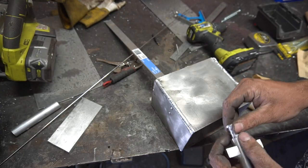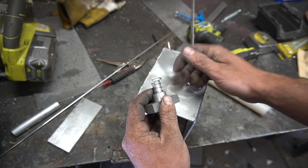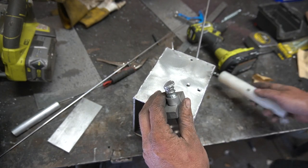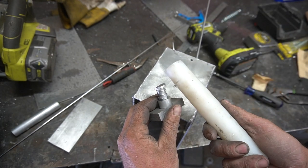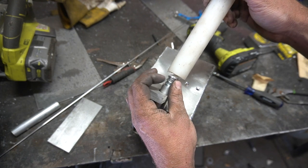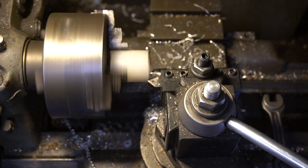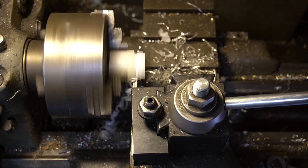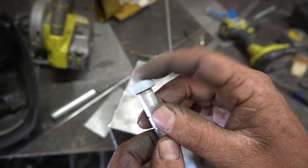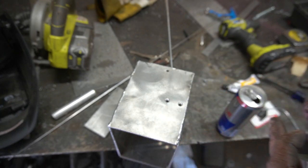I've been playing with this thing and it seems the aluminum bar rubbing on the aluminum is just wearing each other down and it's too grippy — it doesn't slide very nicely. So I've got this chunk of Delrin. I'm just gonna make a little cap that I can epoxy on the end of this and hopefully that'll be a little bit more slidey. I've got this little piece of Delrin epoxied in place and sanded a little ramp on it to where the thing needs to engage. Let's get this installed and see how it works.